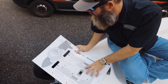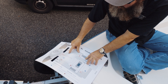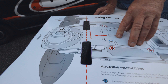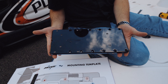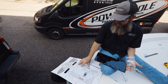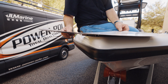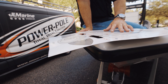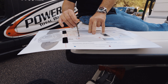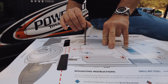In this case, where the template is mounted, we run into an issue on the fourth hole for the quick disconnect. PowerPole has thought outside the box and created a mounting pulpit for this situation. We cannot directly mount the Move to the boat or use the quick disconnect as-is. We have designed two different size pulpits — a short and a long one — and we are going to use the short pulpit to get extra clearance. These are the forward mounting holes for the quick disconnect for the Move PV trolling motor.